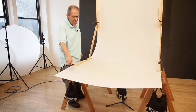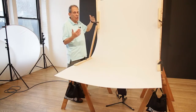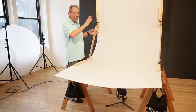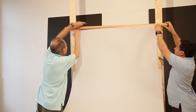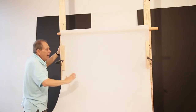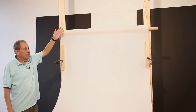Notice that not only is the front edge of this piece of plexiglass bowed, but the back piece is bowed equally as well. When constructing a light table, you want the plexiglass to be relatively straight because it creates more even shadows and light. One way to do that — Matt, could you join me? — is to take the top edge of the plexi and pull it forward, then drop a piece of closet pole in behind the plexi. Now we've curved the plexi this way, which puts it under stress and makes it much stronger. There are no C-clamps — all we're using is the natural resiliency of the plexiglass to position it the way we want.